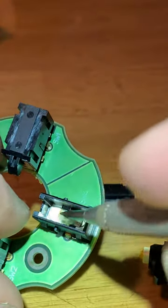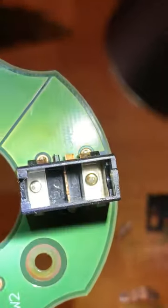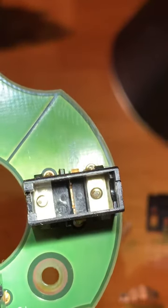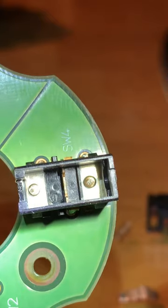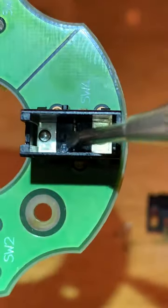The bigger tab goes to the left — the inboard side. Let's pop that off and take a look. If you look at the contact, you'll see the left side is somewhat clean — you can see a little bit of black — but the right side is toast. That is one of my problems. That contact is dirty, thereby not allowing proper contact. So that's what the pad looks like, and that's the other side. The center bridge is the ground — the center conductor — as illustrated by this rib right here. Your two other contacts are here.